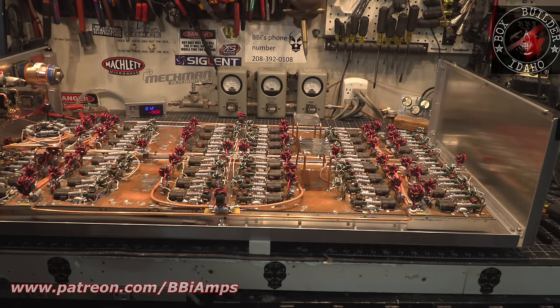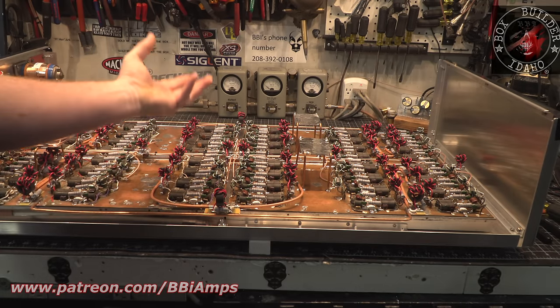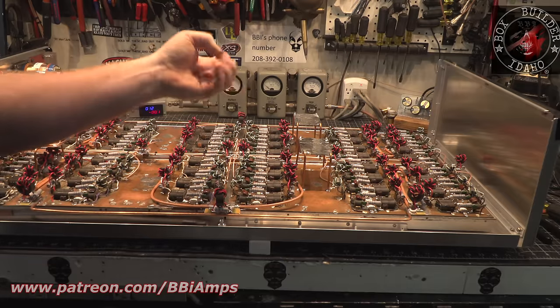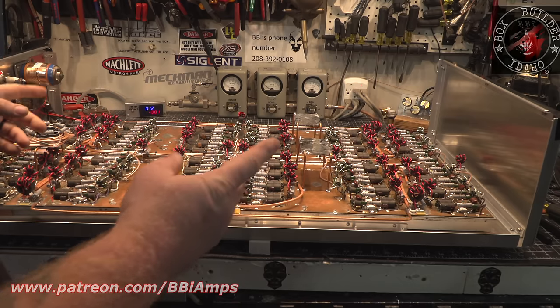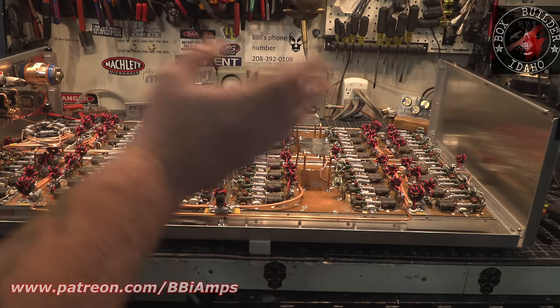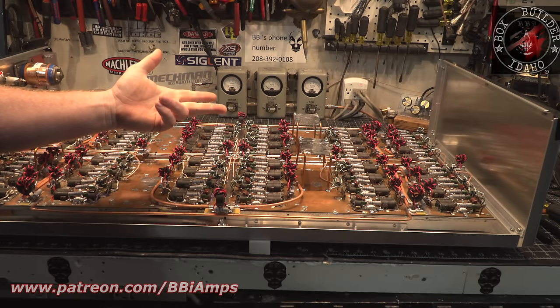If we decide that we're going to do something stupid and put like a 10 pill or a 16 pill into it, that's a different story. That's 660 watts per leg. We're very much on the edge. Now, we know that the 316 can handle 1,000 watts because we use it as output combiner coax in some bigger boxes, 16, 24, 32, 48. The 316 can handle that. But in those amps, the run of coax is only about maybe 2 foot long. So we're trading off the ability of organization, size and flexibility